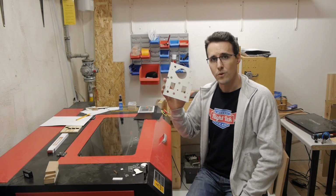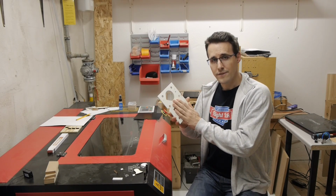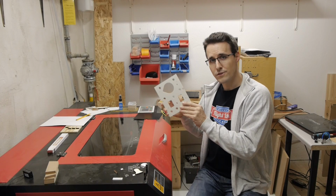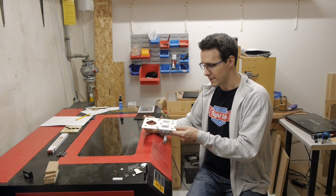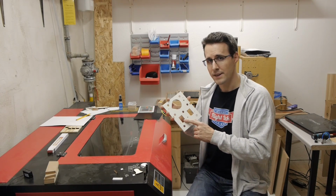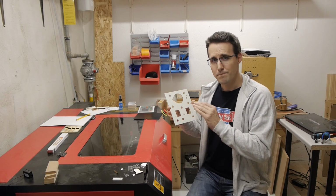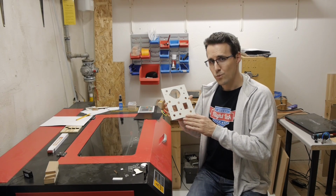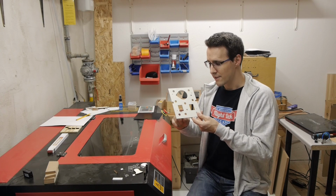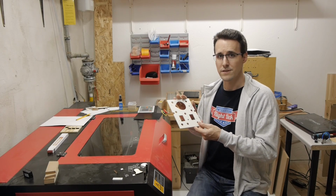This is the white painted top panel part, and I will have to cut out here the holes for the inlays. And I think this can be the mirrored cutout. So I will turn it around and put it into my laser cutter and make all the cutouts. I'm doing the cutouts after the white painting because I think the two parts have to fit absolutely perfectly into each other. And when I cut the holes first and spray paint over it, then paint will also cover the insides of the cutouts. And then the two parts couldn't fit anymore to each other.